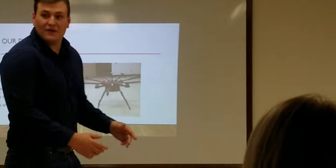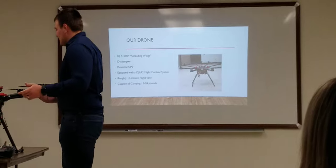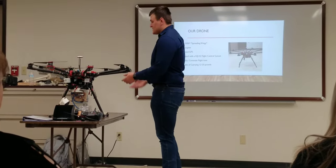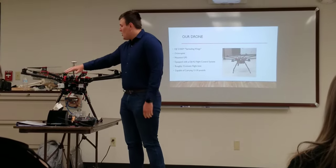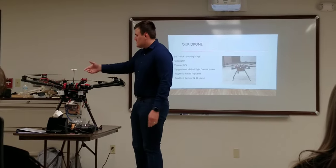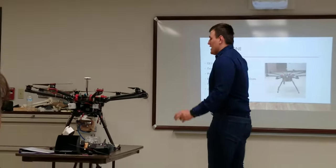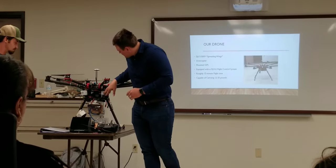I'm Levi. This is our drone — a DJI S1000+, also known as the Spreading Wing. This is a discontinued drone donated to the school by one of our associated companies. It's an octarotor design, meaning it has eight rotors spread across a platform. It has a mounted GPS for locating itself, can self-balance, and has a DJI A2 flight control system that helps control all the motors to keep itself balanced, but it does not fly autonomously.